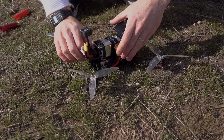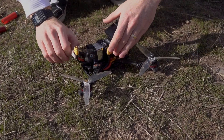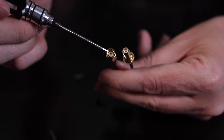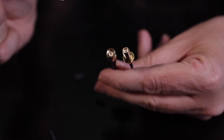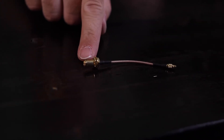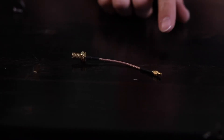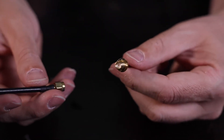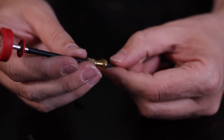The first thing to consider when selecting an antenna is the connector type. Antennas are made from coax cable, which is a wire that contains an inner conductor surrounded by a conducting shield. There are various types of coax connectors, the most common of which is SMA. Most antennas will use SMA connectors; however, for a VTX board, these are quite large. There are other small coax connectors used more frequently on VTX boards — the most common ones you will see are U.FL, U.FL IPEX, and MMCX. Often pilots will use what is called a pigtail to convert between one of the smaller coax connectors to an SMA style connector for their antenna.